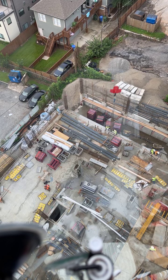So as they get closer to the floor, the rebar on the bottom will actually pitch out, because it's cemented to the floor, and the column is smaller than the rebar they already have settled. So what it will do is it'll pitch out a little bit, kind of put a little elbow in it, and they'll have to do what they're doing right now, which is take a hammer and try to beat the rebar back in, because it wants to elbow itself out on the very bottom.